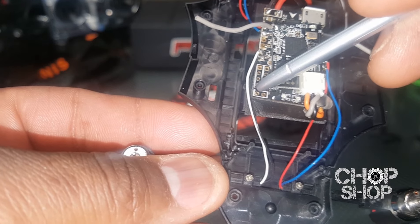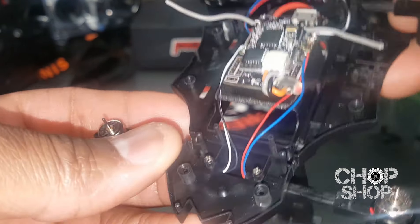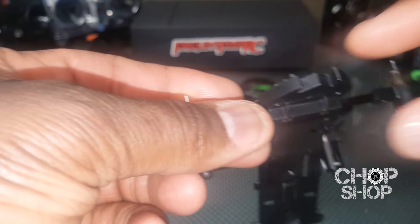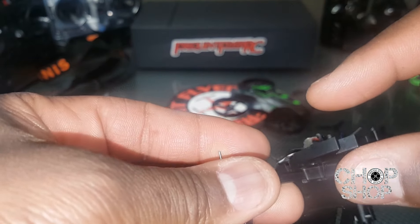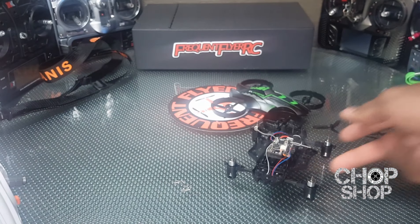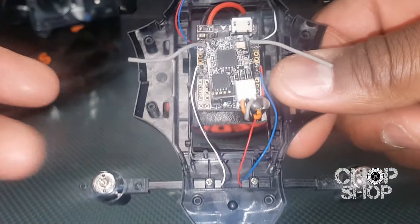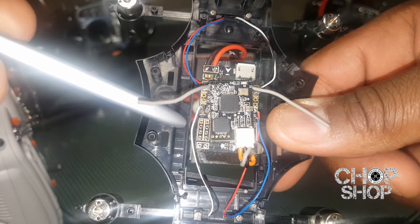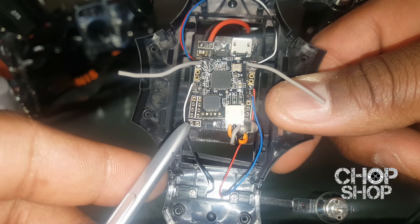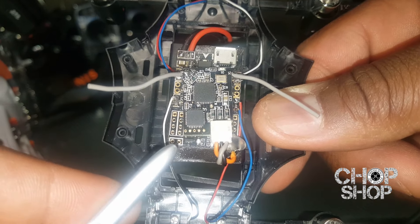Okay, this is the buzzer spot here — the two pads for the buzzer. I was thinking about FPV but not quite sure yet. I was thinking about cutting a little spot and placing an FPV cam facing forward, one of those little all-in-one FPV systems. But for sure we're going to add a buzzer. The soldering iron is heating up right now. This is an F3 SP Racing EVO board, and I already know from experience that on these buzzer pads the hot wire is always on the outside.